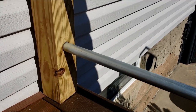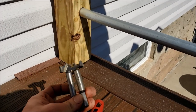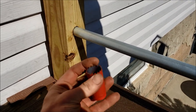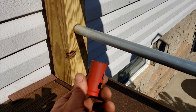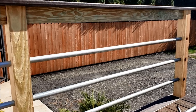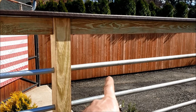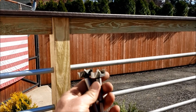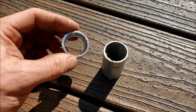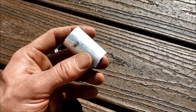Another complication with the one inch conduit is most wood boring bits you'll find in stores go from one and one quarter to one and three eighths, and the outer diameter of this is actually one and three sixteenths, so I had to special order online. That got me looking up other options and I decided on chain link fence rails for the top rails. These are a true one and three eighths outer diameter and the wall thickness is over a hundred thousandths versus the conduit's fifty-five thousandths, so you get a much more rigid pipe.